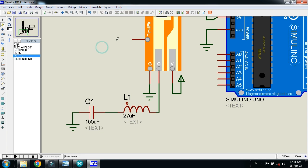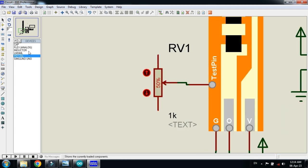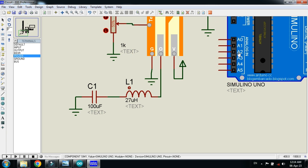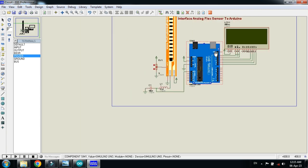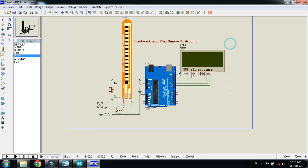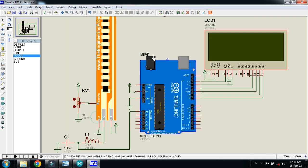Connect the potentiometer to the test pin of the sensor. Connect the power and ground with the potentiometer as well. Now connect the out pin of the sensor to the analog A0 pin of the Arduino by picking the wire and interfacing it there. Zoom in to verify the connections. The circuit is almost ready — save it.